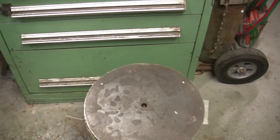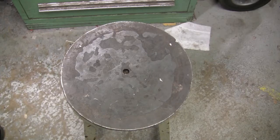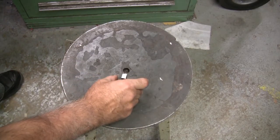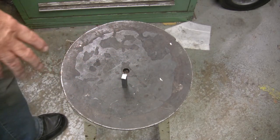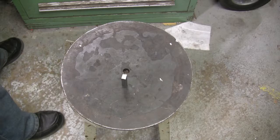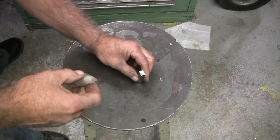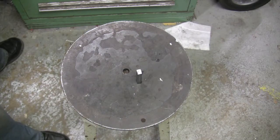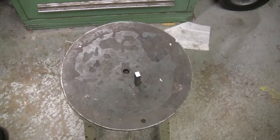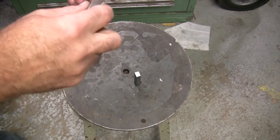I've got a steel plate here that I use for setting up stuff like this for silver soldering. I'm going to set it like that, but before I do that I want to get some alcohol and clean the end with it — you've got to be clean when you're silver soldering. Apparently my battery went dead; I switched batteries. You clean that with alcohol and take the carbide and clean it up with some alcohol too.